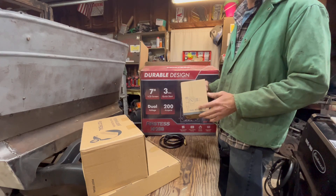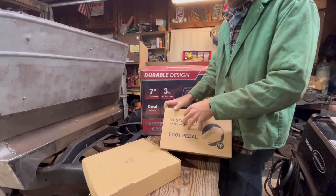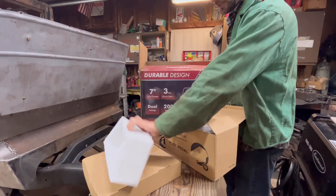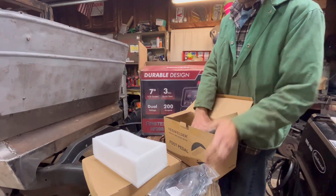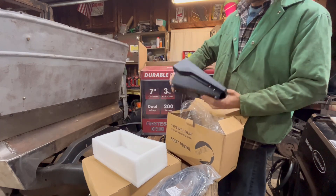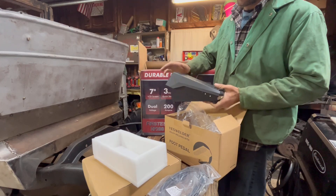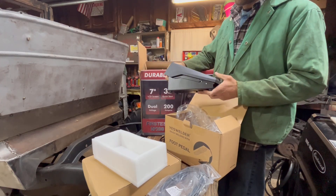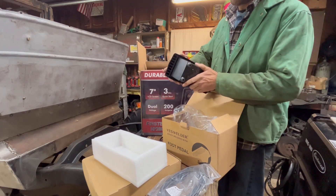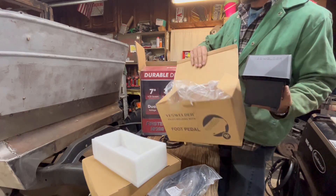It comes with a float meter, so this is a little more accurate. We'll probably put this on when I do some TIG welding — it's a little better for TIG. The bundle also comes with a foot pedal. While they call it a lift arc TIG, it does come with a foot control as well. It looks like a pretty nice, well-built pedal. I've been using my Eastwood TIG, and it has the small pedal with the arch over it, and I've found that's hard — I got big feet, it's hard to get my boot toe in there. So I'm excited to try this.